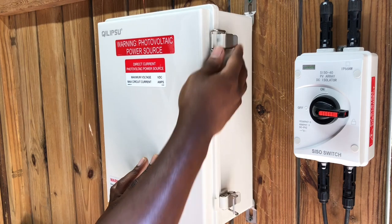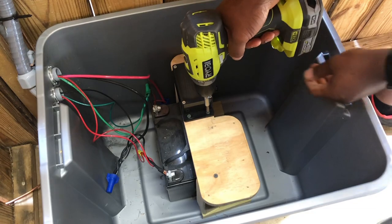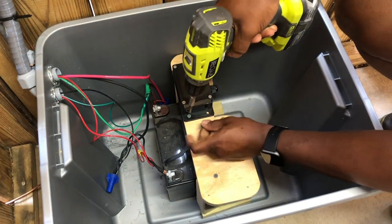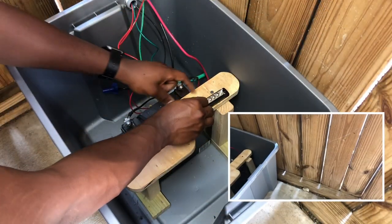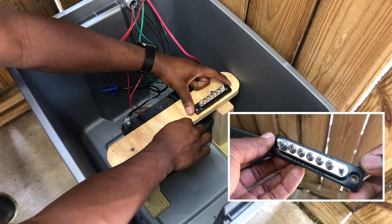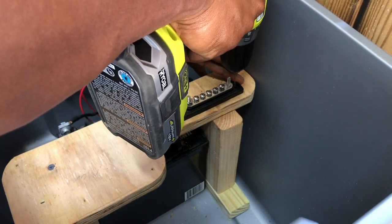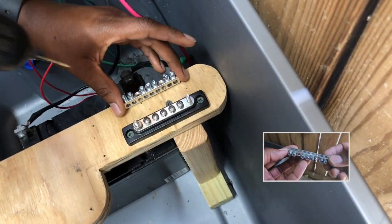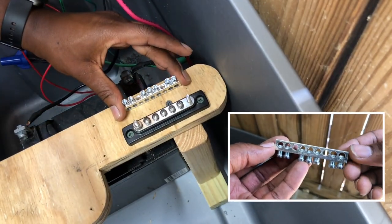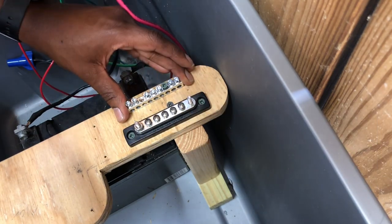Before getting started on my electrical work, I disconnected my solar power source. Next, I prepped my electrical tote by removing components that would no longer be required. I also wanted to create a dedicated positive and negative bus bar inside my electrical tote so that it was a little easier to visually see most of my electrical connections and so that I could quickly connect and disconnect the electrical wires. I ended up using two different types of bus bars since they were the only types I had on hand and I wanted to keep the overall cost low, but they accomplished the same goal.